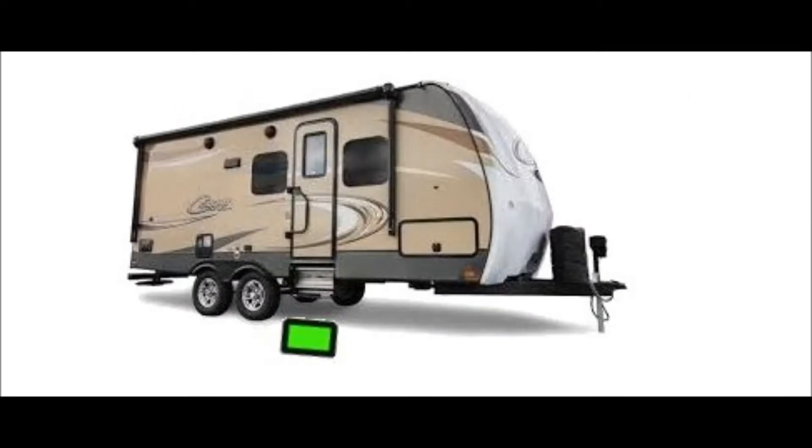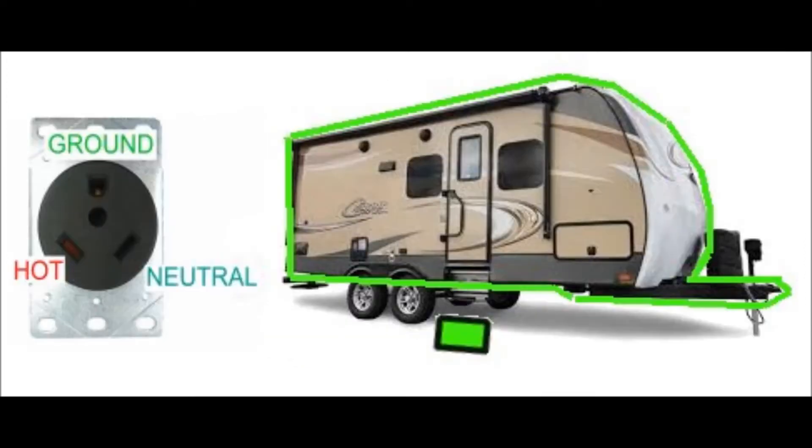Let's say this is your RV. I gave you a green welcome mat to represent that big mud puddle outside your door as well as electrical ground. Because the tires insulate the trailer from the ground, when we plug in, the presence of AC begins to build up a capacitive charge on all the metal surfaces of the trailer. To prevent this, the chassis is connected to the ground prong of your plug, safely draining away any static charge that would have built up.